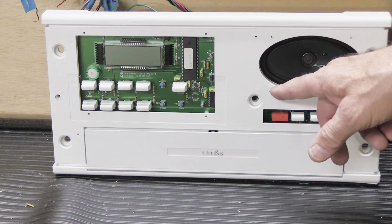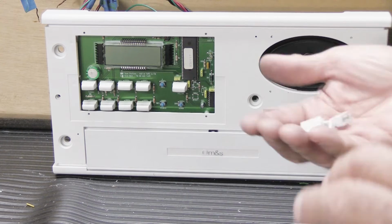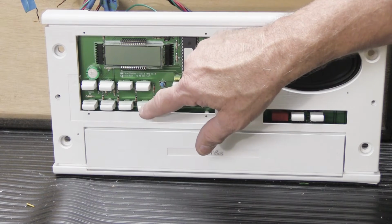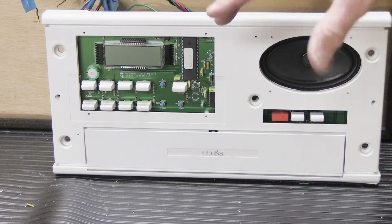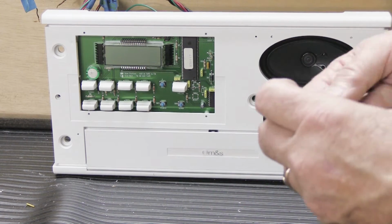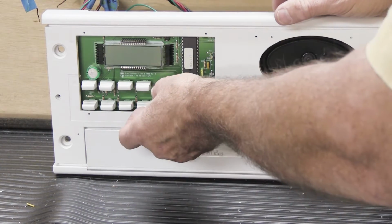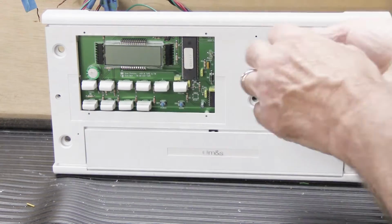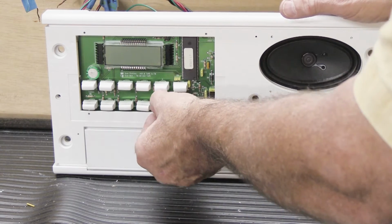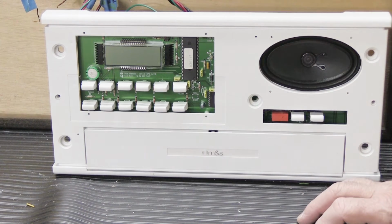So here's our uninstalled Music and Sound MC602, and it looks like it's lost some teeth, but they're not really teeth, they're just button caps like this. The button caps on an MC602, as you can see, are very wobbly. With all of the turning and twisting and undoing and moving it around and sliding down on the wall and all of those good things, 3 of them just came loose. It's not a big deal because they just simply fit over the ends of the stems of the little blue switches right there, like that, and like that. And finally, like that. Now it's got all its teeth back.